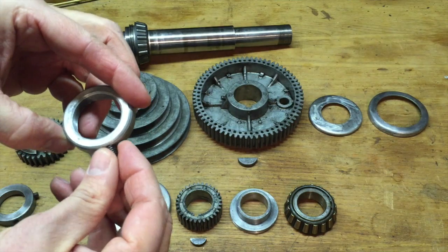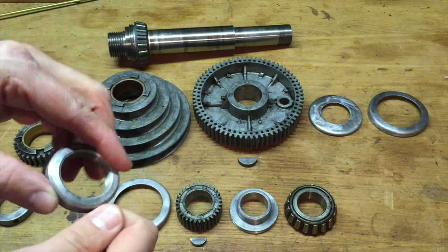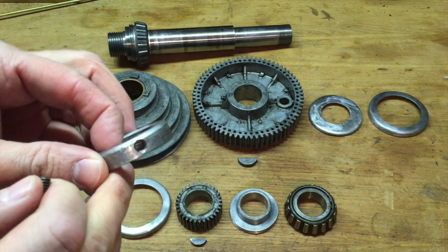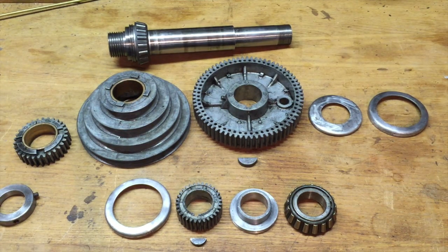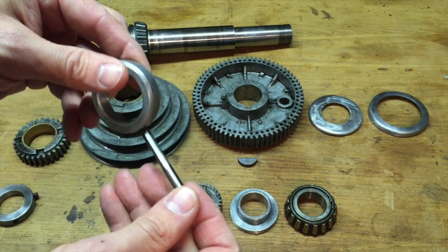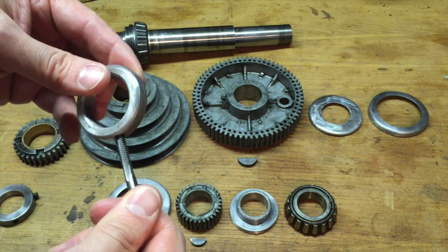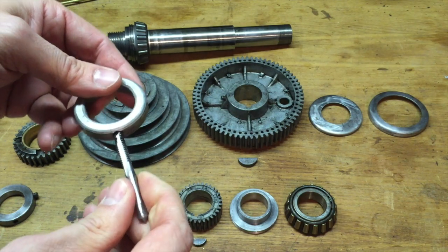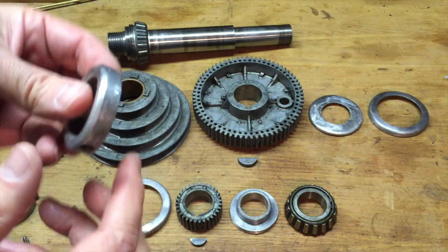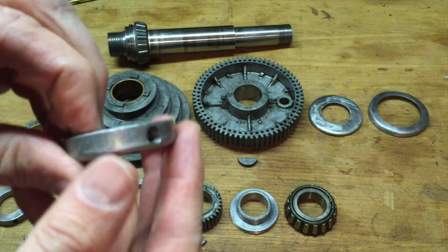but for some reason they just don't want to go in. And these are a 1/4-20, and I wouldn't see any reason why this hole would be any different. When I try a 1/4-20 tap, thinking maybe I can clean up the threads, it'll start, but obviously it's getting caught. I've never used a tap or a die before. I look in there and the threads seem fine. They don't look damaged at all.